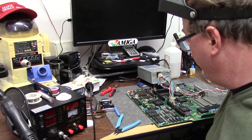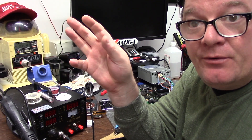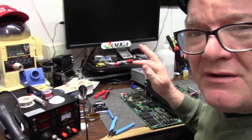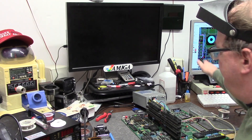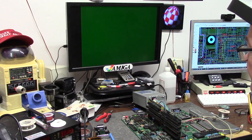10:35 — Mr. Allen's board. I'm hooking the power supply back up. I found one capacitor that kind of popped through and broke a trace — it was a decoupling cap near the power supply. DiAGROM is in. If this works, I'll get the DiAGROM flickery-flickery-flick-flick. Here we go... yes!